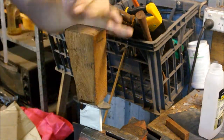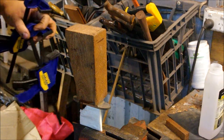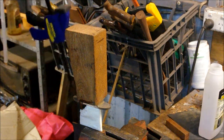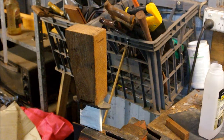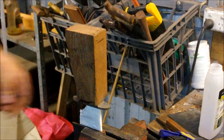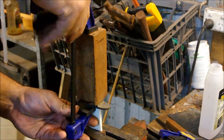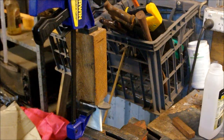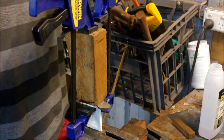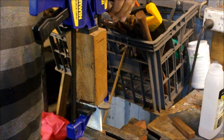And make sure it's all clamped up. Now, this blade is too long for my longest clamp, so instead of clamping, normally what I do is put a block of wood at the tip of the knife and clamp between the tip and the butt of the handle, push it all together. In this case, I know that the guard is friction fit quite solidly, so instead I'm going to clamp from the guard to the handle. And you want to make sure to do it both sides, otherwise what you're going to end up with is an uneven handle to guard fit up.